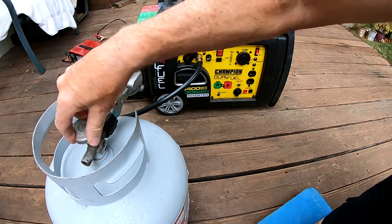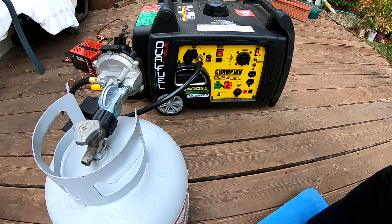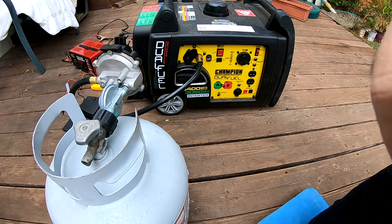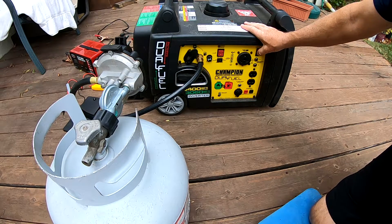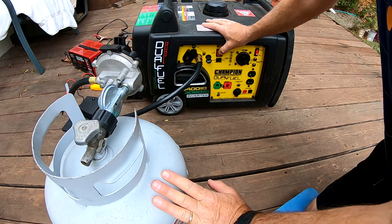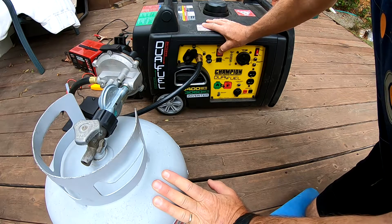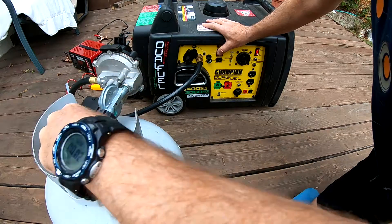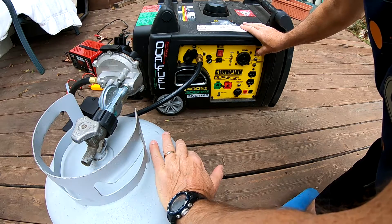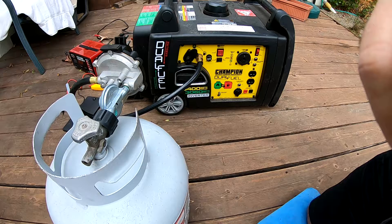It's been running 20 minutes, so we're going to shut off the gas — this will shut off the engine. We'll turn off the battery for a second, let it sit, and then try restarting it to see if the battery has enough juice. It's been sitting for a minute — we're going to turn the battery back on. It'll start on the first try if you pull the choke out on propane. We'll see if it starts; if it does, we'll button it up. It doesn't have enough charge, so I'm going to put the battery on trickle charge and let it charge up for a few hours, then hook it back up and try again.